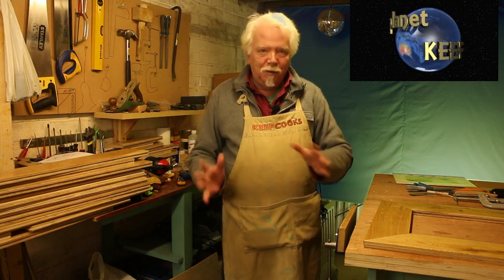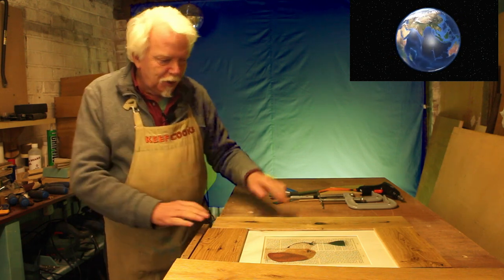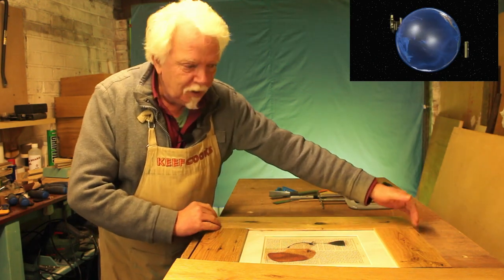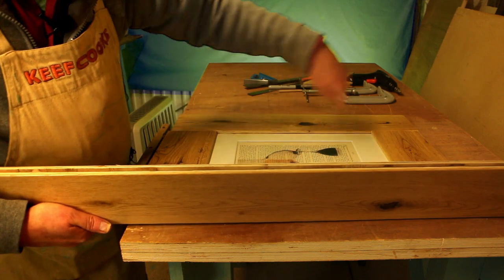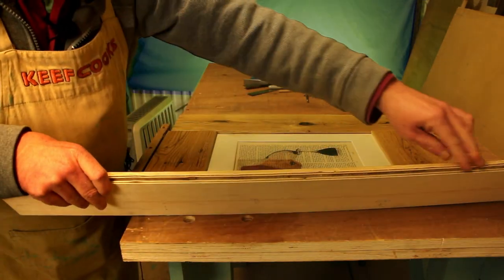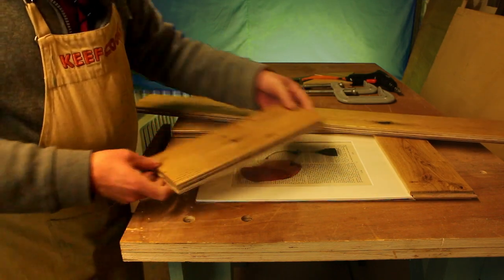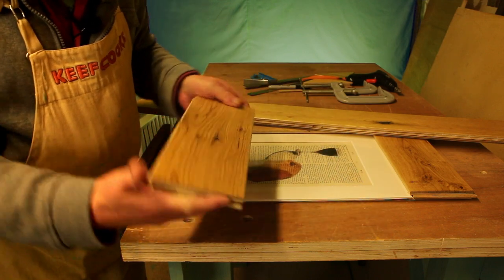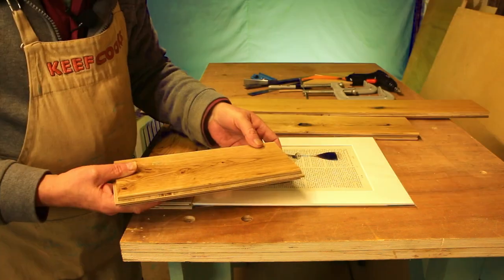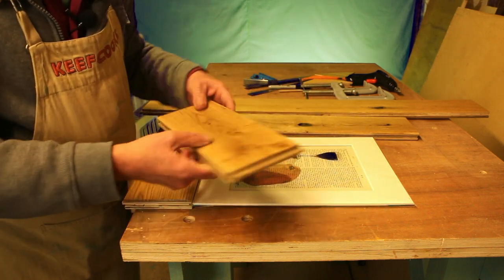I've reverted to a different style of picture frame that doesn't have mitres. I'm going to adopt the style of design used for the cabinet doors in our kitchen — vertical stiles and horizontal rails. The stiles go the full height of the frame and the rails just fit in between. You need to have the inside groove as the inside of the frame, and then the tongue on the other side you'll have to cut off. On the rails, because the ends are also tongue and grooved, we want a tongue on both ends — we don't want a groove on this end.